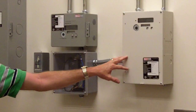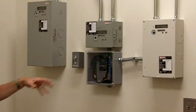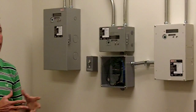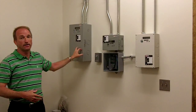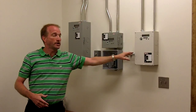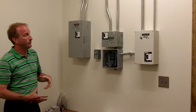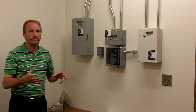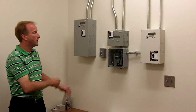It collects the data once a day. The meters record the data on fifteen-minute intervals, or you can set it up for whatever interval you would like. These have a sixty-day memory and the scan transponder has a forty-day memory. So if you lose power or whatever, you've still got your data because it's a non-volatile flash memory that's going to hold it.